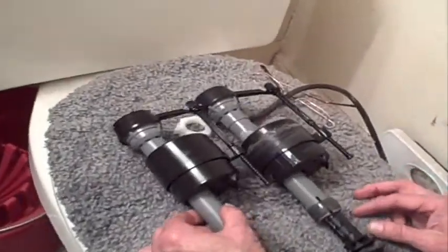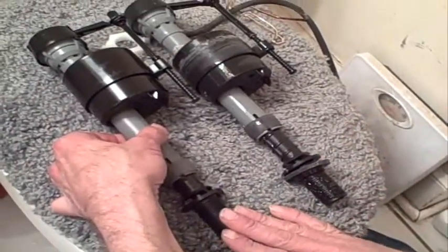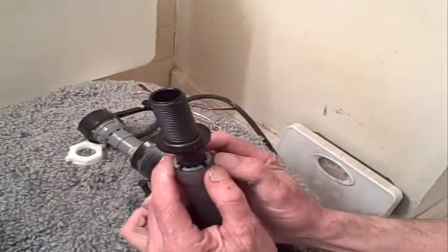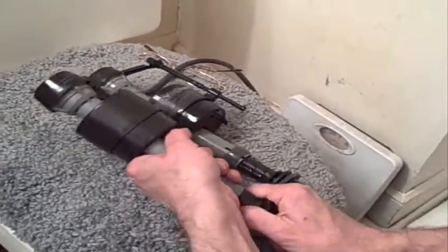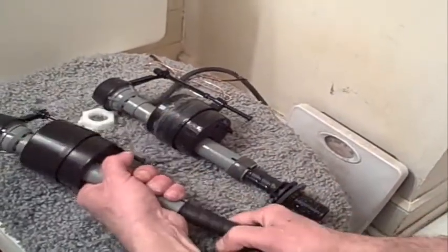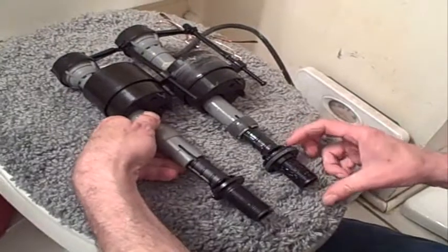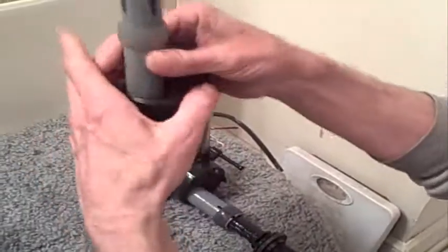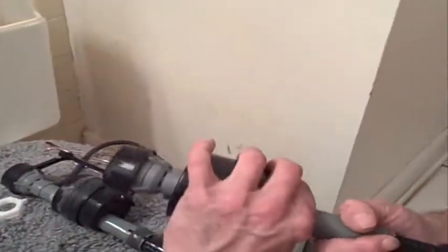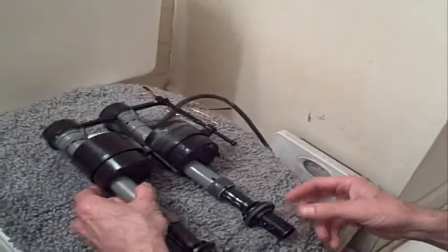I bought a Fluid Master, but that's just because it's universal. Look at the height — you see there's a height difference here? I need to make this one a little longer. This one's fully adjustable. What you do is push down on this little ring and it comes off and slides up. Turn and pull until they're both the same height. Pop that little ring back on there — see that? Pops right back on there. Easy as pi. But not algebra.